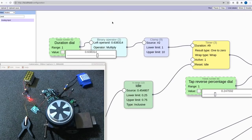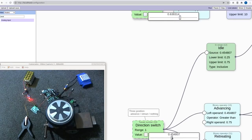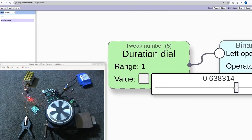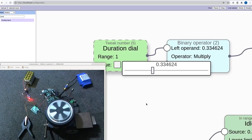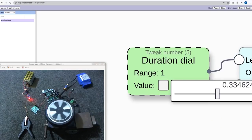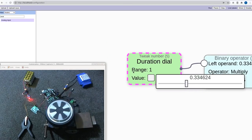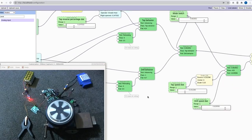We can adjust the duration dial — set it very short and the cycle is much quicker, not getting to go forward much before doing a little back. The tweak nodes are also useful just for sitting and figuring out what numbers work best. The tap speed is around quarter speed right now. Whether that's too fast will depend on the material — it might be fine for 6mm aluminium but maybe a bit fast for 12mm plate, and it also depends on the thread size. The tap reverse percentage at halfway means equal time in both directions.